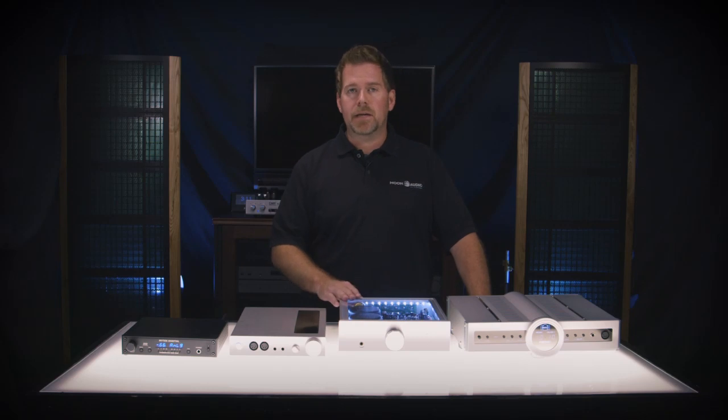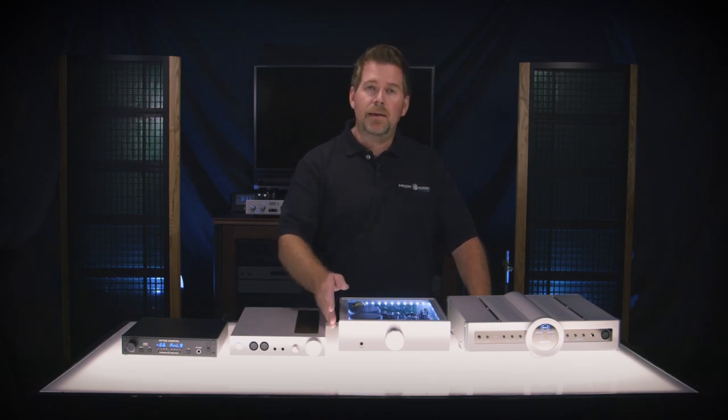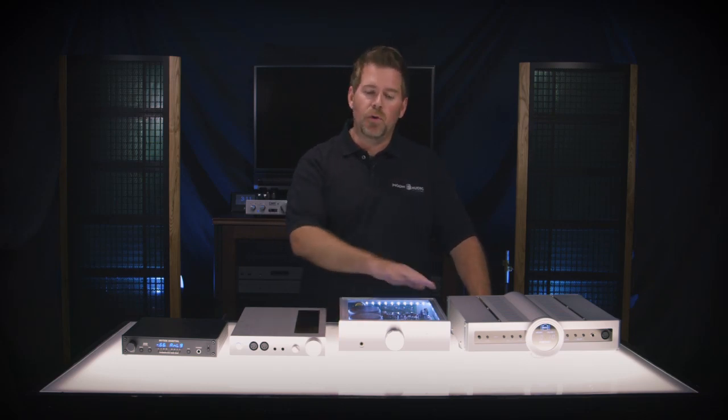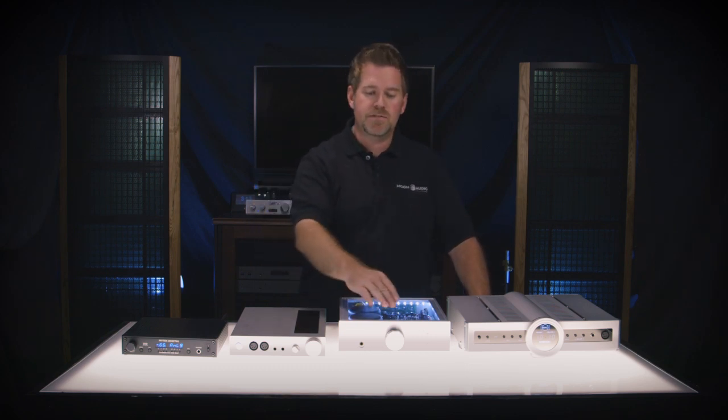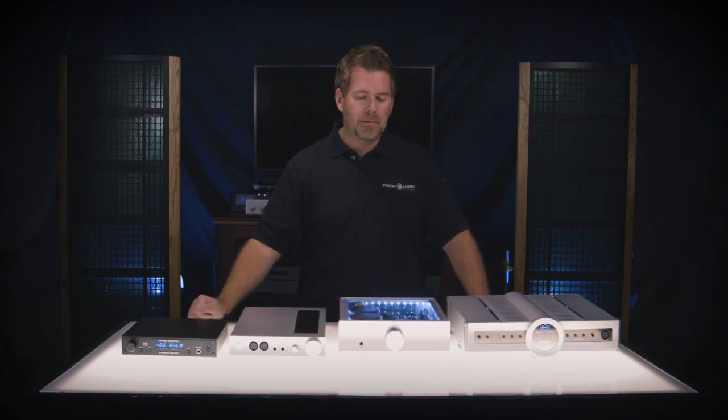So if you don't need all the inputs and outputs, going with the a little less expensive Conductor SL 9018 will maintain the same DAC board, but you don't have the analog outputs for the DAC or the preamp outputs. You lose one of the analog inputs, and you lose the toslink input. It goes from a machined chassis to a folded aluminum chassis, and the volume control is changed from the resistive stepped attenuator to a Noble pot. Still a great value at $1550, a good piece.